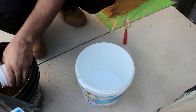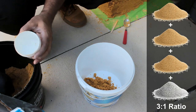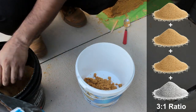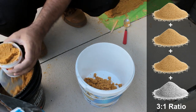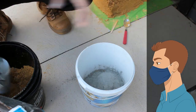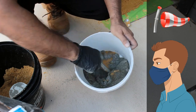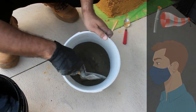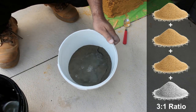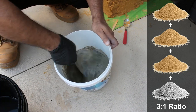To prepare the mixture I'm going to use the commonly used 3 by 1 mixing ratio. Mixing a small amount of sand and cement in a bucket by hand is not only fast but very cheap for any small DIY job around the house. Before mixing the cement, please make sure you wear a mask and try to mix it outdoors. When mixing outside, check the wind direction and make sure the wind is blowing away from you. Occasionally rotate the bucket while mixing until you get an even mixture, then add some water. Don't go mad and add a lot of water, as I nearly did here.